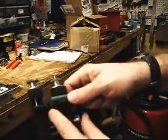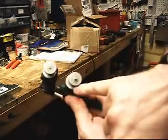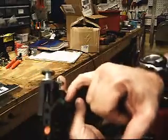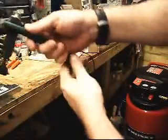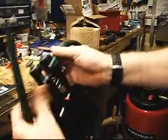Alright, so it's kind of close in the center here. I'm going to slide it over. And as I said, put your fender washer as close as you can to the front side of this tip that's holding on to the actual belt itself. So now it's tightened down. I'm gonna bring the belt around, not put any kinks in it, just bring it in a nice natural motion